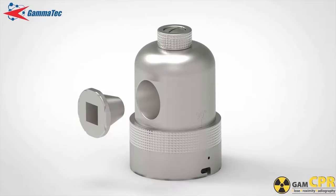Fit the collimator aperture selected for the specific application into the collimator as follows. Loosen the lock screw at the front of the collimator using the flat screwdriver, approximately two to three revolutions. Loosen the thumb screw so that the collimator connector ring slides away from the collimator body two to three millimeters.